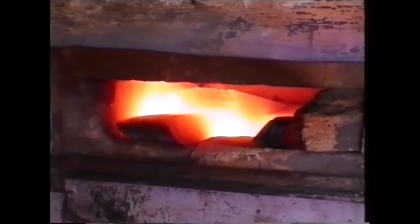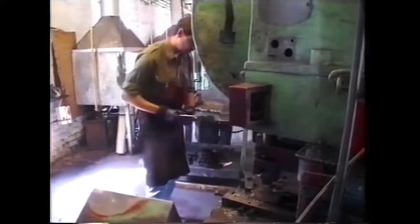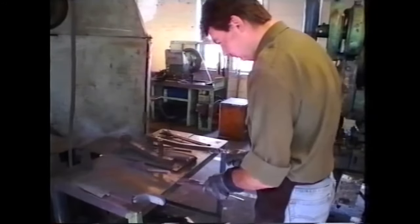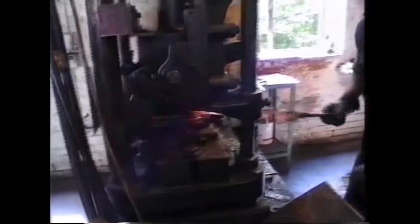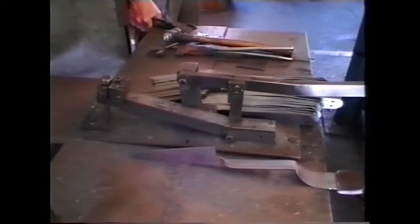After they've been cropped and punched, they go into a furnace at about a thousand degrees and they're formed on this machine, marked on the next machine, hollowed on the next machine, and the points are pulled in on the next apparatus — all heated once. That's forming, marking, hollowing, and pulling the points in, and generally straightening the shear up.